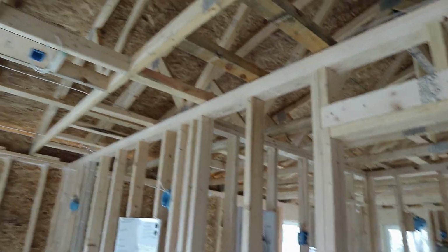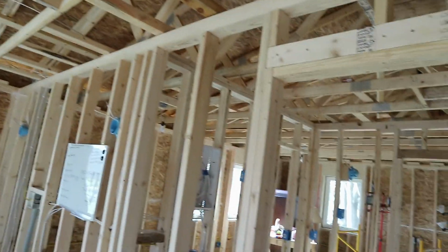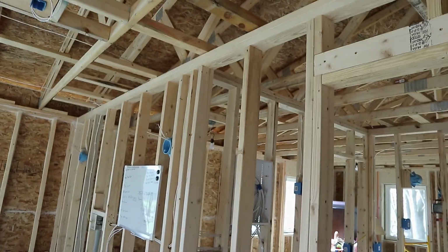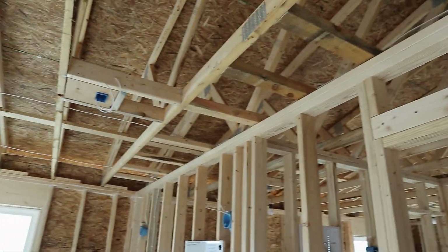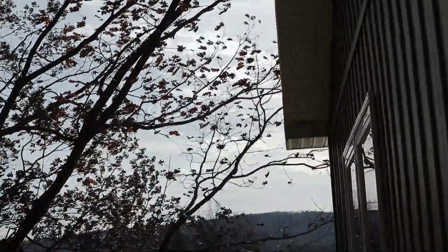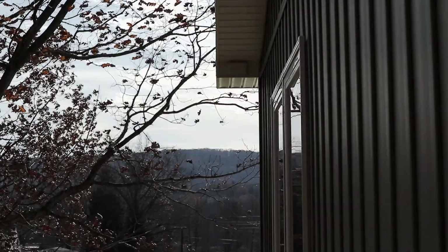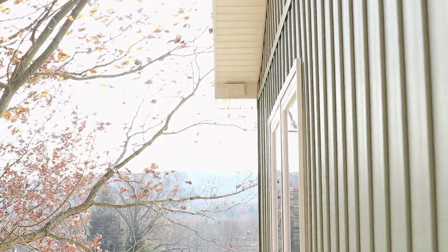Partially because all of these roof trusses have a bit of camber to them. And I can't really pull the wall up to them or pull the trusses down. So I just have to shim them. Right there, can you see it? Barely, huh? Can I adjust the exposure? Yes, I can, there. Right there.